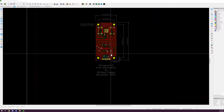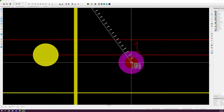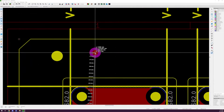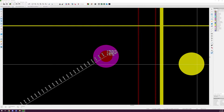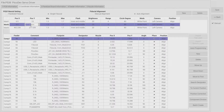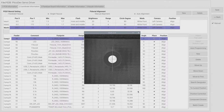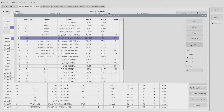All these component references are with respect to the place origin we saw earlier. But the pick and place machine needs some way to find the panel within its build volume, and so these three fiducials on the rails are how we do that. In KiCAD we can measure the location of these fiducials with respect to the place origin of the bottom left board. That fixes those three points with respect to the first board on the panel and we enter that information here. When the machine ingests a panel, the first thing it does is search for those three fiducials with the down camera, and once it locates them it knows where the first board is going to be placed.